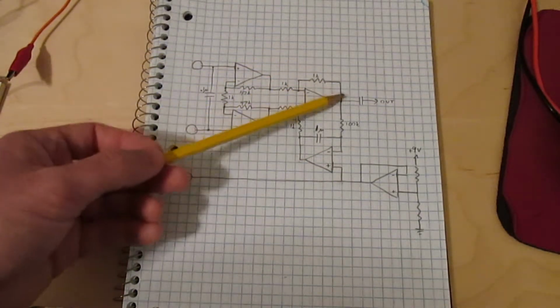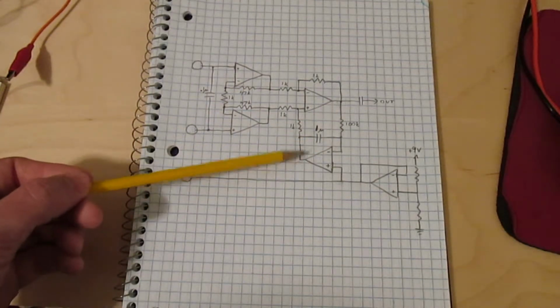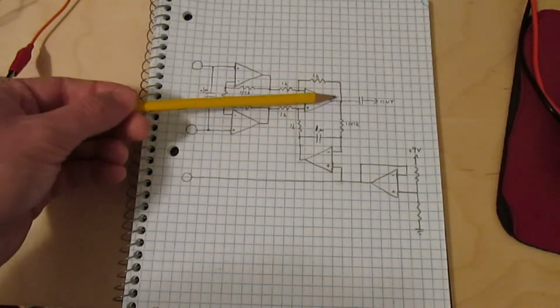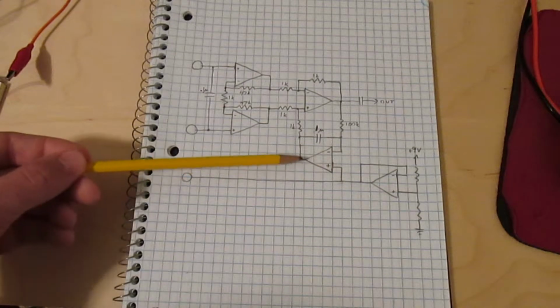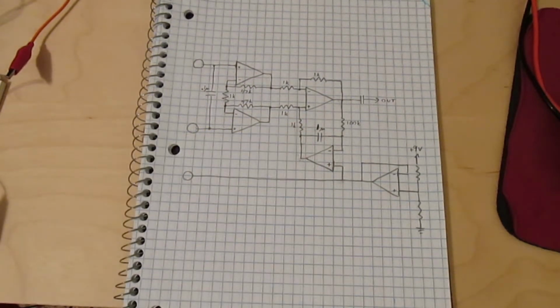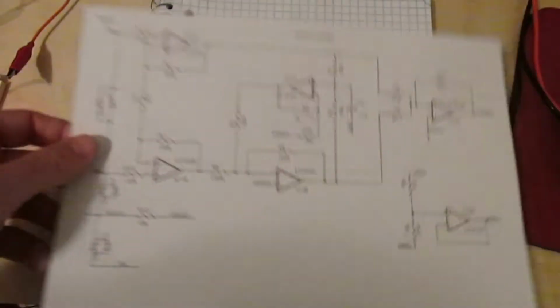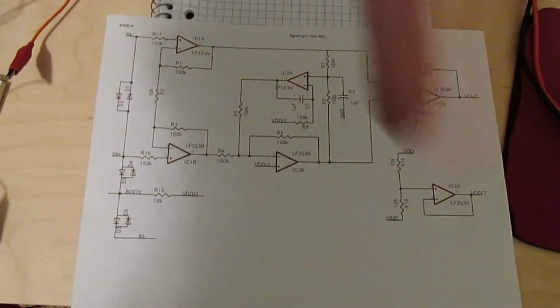So if the voltage at the output is too high because of a DC offset, this output here will steadily fall over time and subtract off some voltage from it until eventually it reaches the same voltage as this reference, and then the output will stop changing and stay where it's at. This DC offset correction control loop was also used in another homemade ECG project I found online, which I'll link to in the description down there.